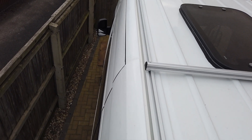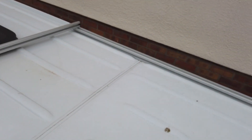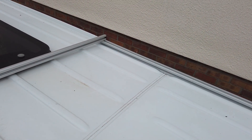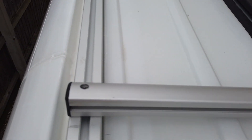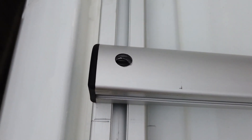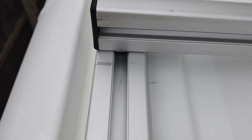So the progress so far: the left rail is on, secured, and sealed. The right rail — which is much shorter because I'm not having an awning on the driver's side — is also secured. I put the front radius on and I've secured it downwards with an allen key. That is the only way of doing it, but at least I can move it backwards and forwards to align with these lines. It misses the sunroof and it's aerodynamic on the solar panel which is coming next.